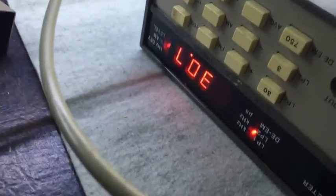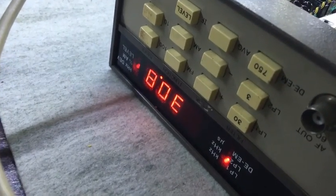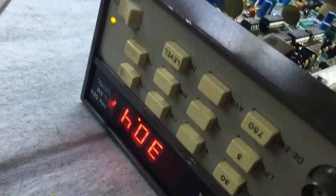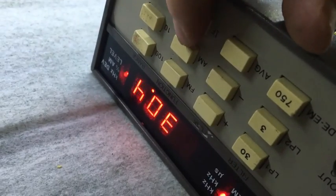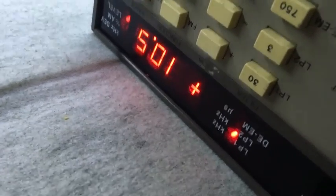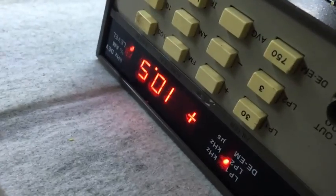There's a diode there which I've just put in on the inductor. I've just hooked up the power, turned it on and we have 30% modulation level — not deviation, that's FM. And as before 30% there, 30% there. Level adjustment on here — this button's a little bit dirty, I need to give that a clean. And that is actually showing a level. So yeah, that's all good, I'm happy with that. The unit is actually working now.